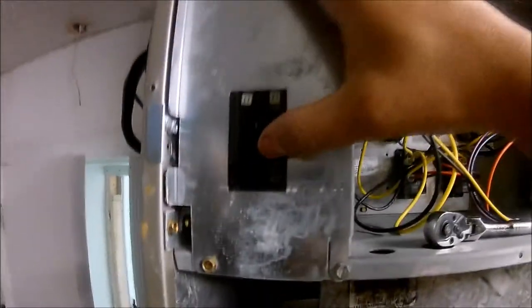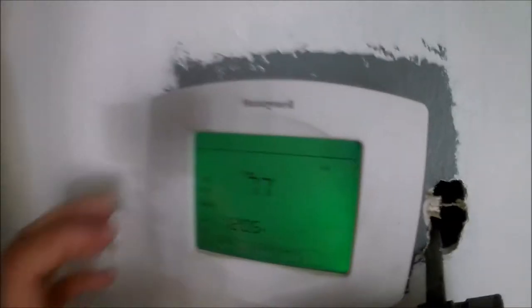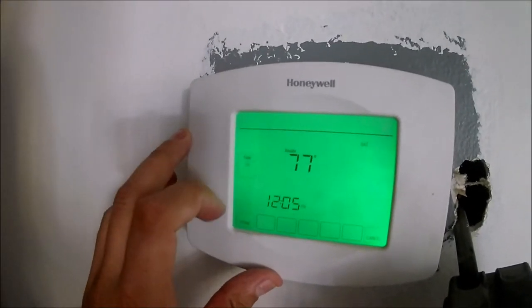We can test it now — turn the breaker on. We're going to turn the fan on. Once this unit comes on, put it on — it has to blink, actually — off, on. Just give it a minute. There it is — full speed! It's working. It's alive. Now you have to put the screws back, the cover on, and then you're good to go. This is the fan that will suck all the air out of your house and send it through the coil underneath; the air will go up and blow right back up into the house.